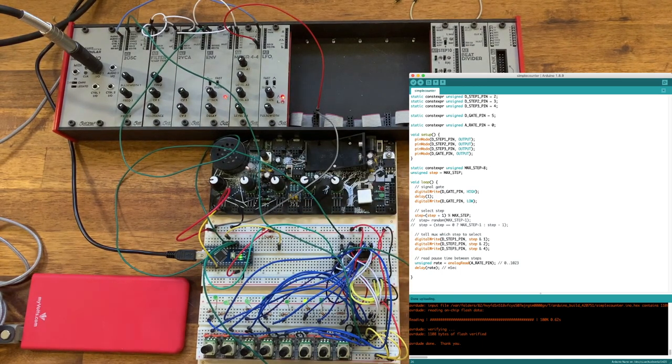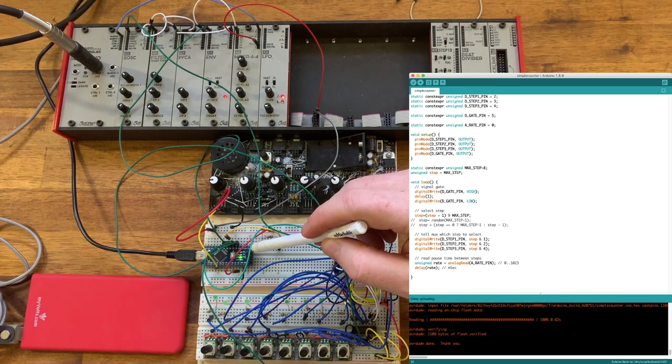We mentioned at the start of this video, for example, that using this same logic, we can replicate these potentiometers and use another mux and get different automation lines. But we can also use more potentiometers and a different mux and actually create a longer sequence. So we could create a step sequencer of 16 or 64 steps. Now, the trick to that is that these mux chips have an enable pin. And what that enables us to do, from the microcontroller, using digital write again, is select which mux we wish to use. So you can think of different automation lanes as running the muxes in parallel. And if we wanted longer sequences, they would be run in series and we would select which mux we were using by the microcontroller.